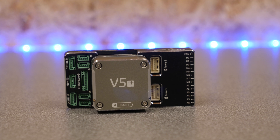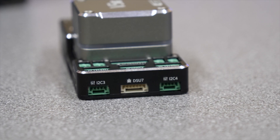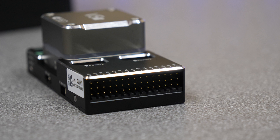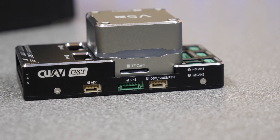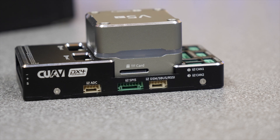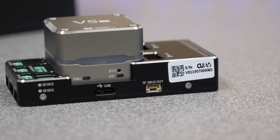Taking a closer look at the controller, you'll notice the design is very familiar with a cube and carrier board arrangement. On the bottom you have the main ports for GPS, telemetry, UART and CAN bus. Moving around to the other side you have a number of I2C ports and a DSU-7. You still have dual power ports as well as the standard RC servo ports, analog digital connections, and separate SBUS and PPM inputs and outputs. There's an SD card on the side of the autopilot and below it an SPI port for connecting external sensors. On the other side you have an S-Bus output as well as a USB-C port, which is where you connect it to the software for uploading firmware.